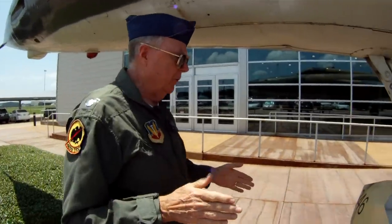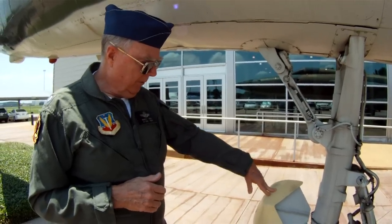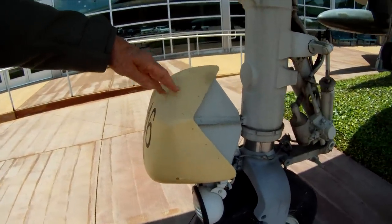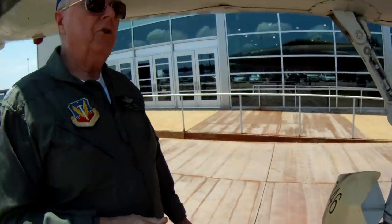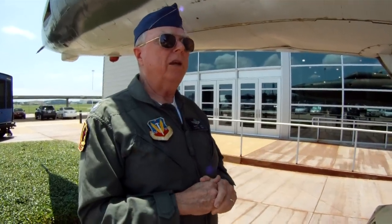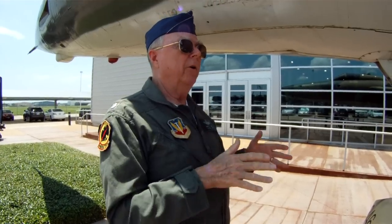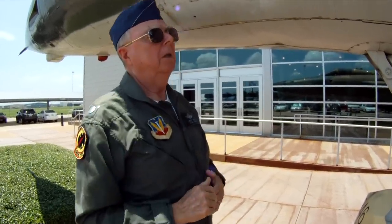An interesting feature is this airplane was actually way ahead of its time as far as stealth goes. This is a corner box reflector for radar, because under normal conditions, if it was raining or bad weather on GCA final, the GCA radar would lose the airplane because it was so hard to pick up on radar. The main reason is not only is it a very smooth shaped airplane, but the engine is what we call buried — the engine is not seen by radar. The radar doesn't look down the intake and see the engine; it's buried in the fuselage.